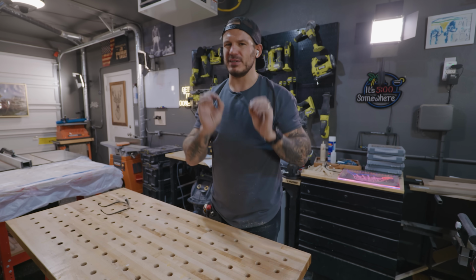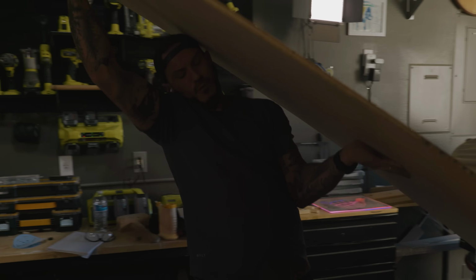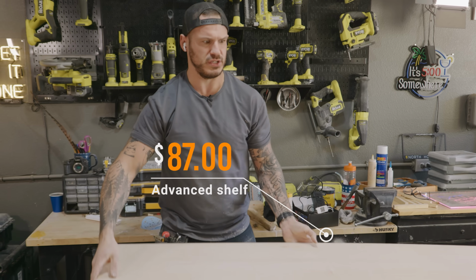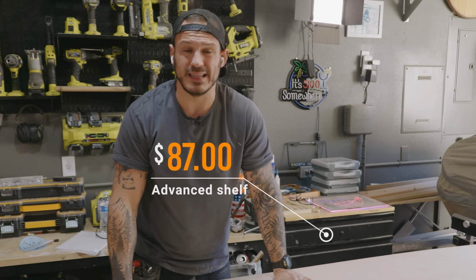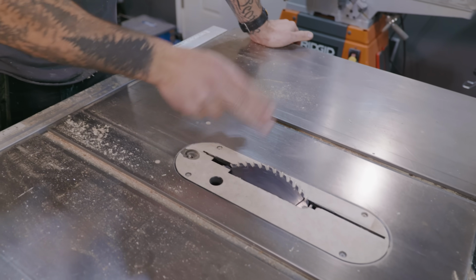These are just gonna be pristine. I bought 1/2 inch maple plywood that is 4x8. It cost me $73, which is absurd. We're gonna start cutting this on the table saw, making all the cuts mitered. So mitered means that every angle is gonna be 45 degrees.